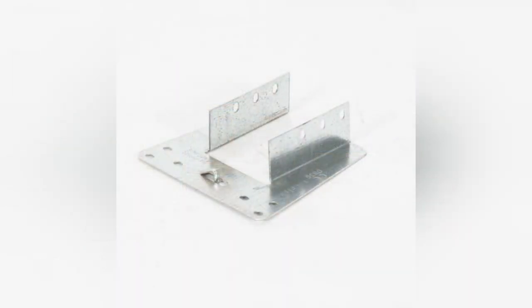To attach the roof rafters to the wall plates I bought a big pack of truss clips and used those to tie down the rafters to the top plates with galvanized twist nails, so there's no way the roof is going to blow off. For screws and miscellaneous items like nails and paints, I've added £150 — I'm sure that's over the top for what I actually spent, but that way I know it's covered. The entire build came to a total of £2,487.54.